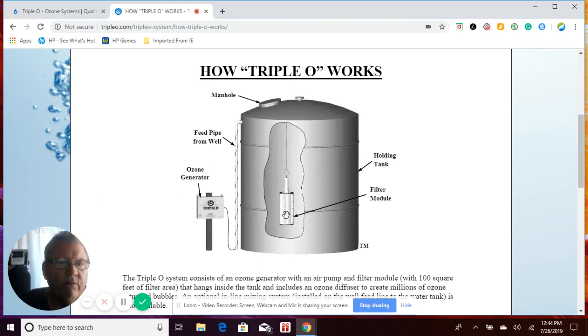As you're spraying it off, you use a gallon of muriatic acid that you pick up at the pool supply place, and you take the ceramic diffuser and dip it inside that acid while your ozone system is running. That will clear the iron, manganese, and sulfur that has collected on the diffuser over the period of time between your cleaning periods.